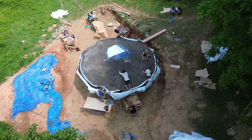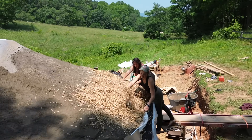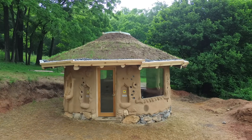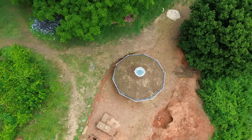To build up the layers of our living roof, we start with a base layer of sand, followed by a layer of straw, and then lastly a layer of local clay soil. To finish the roof, we build drainage downspouts, attach fascia boards, and install a skylight in the center of the roof.